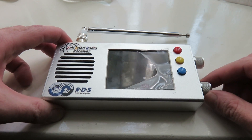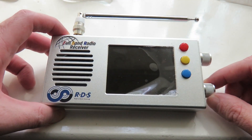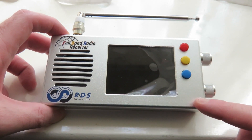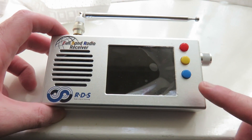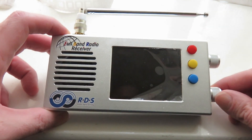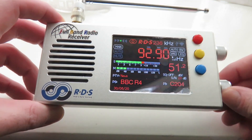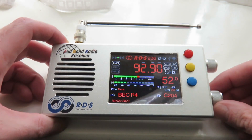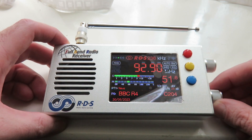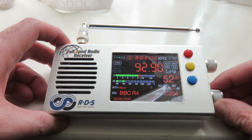I've been asked to do a tutorial video on flashing the firmware to 2.0 beta. Even though I've already flashed my own radio to 2.0 beta, I've put it back to 1.21 for the purpose of this video. Let me just switch this on — it's got the 1.21 version back again. So what we're going to do is go to our computer and get the necessary files needed to flash our TEF6686.